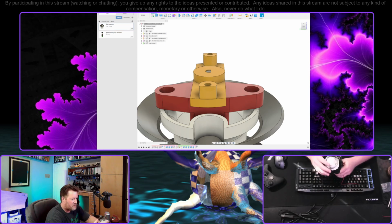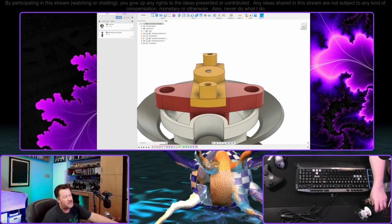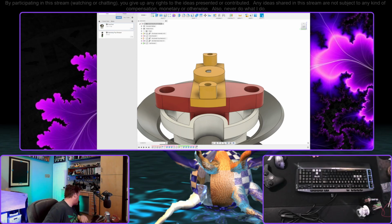And the top part of it is still pretty wobbly. I want to fix that as well, basically by sinking that more. And then the standard pop bumper screws that I have are both holding the bottom to the base and the pop bumper cap to the bracket. The bracket screws are too long and they interfere with the other one. So I happen to have a ton of old printer parts. I think I'm gonna grab a couple of M3 screws and use those for now.